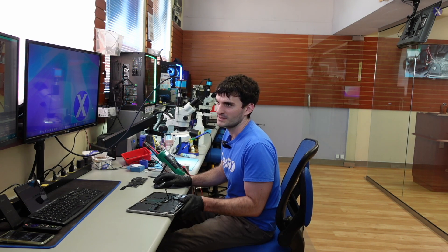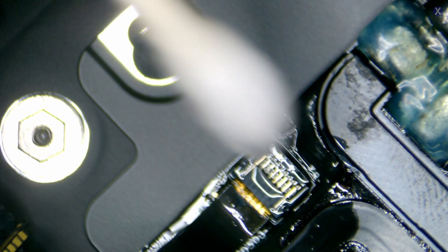Let's take a look at the battery connection before we get into the logic board. This looks to be a little bit corroded — we don't want to just pull it out. Let's dab it up and just loosen it so it doesn't stick. Let's remove it — it doesn't look that bad. It came out perfectly. This needs to be perfect because this matters about it working. It looks like it's just discolored, not actually burned. All the pins on both sides look to be okay too.